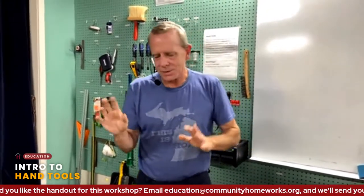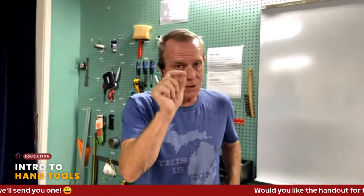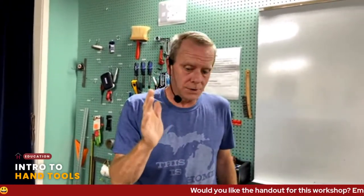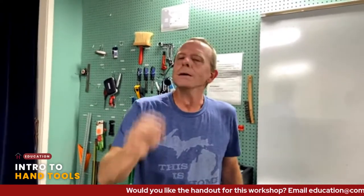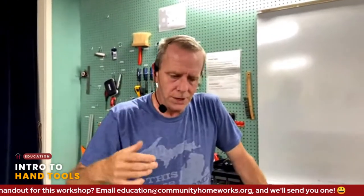I say that just from experience. I have multiples at home, and I'm going to run it, I'm going to check it. What I'll do is have a very small nail or something like that, and I will check to make sure that whatever it is I'm trying to find, well, maybe not an electrical wire, but if I'm trying to find that stud, I'm going to put a little nail in there, something that I know I'm going to cover up or can spackle real easily.